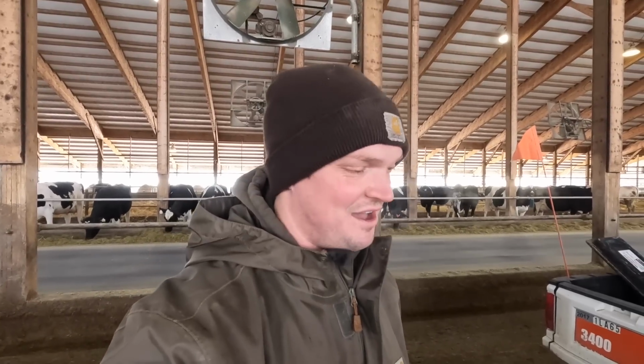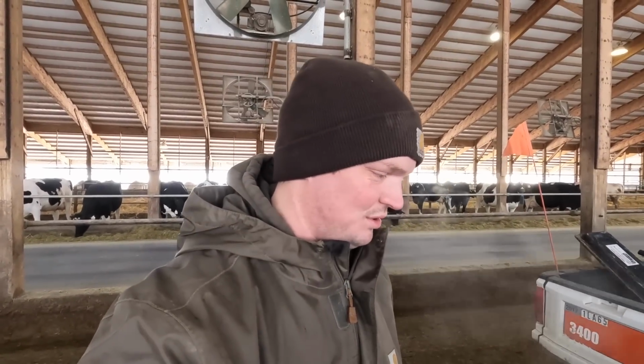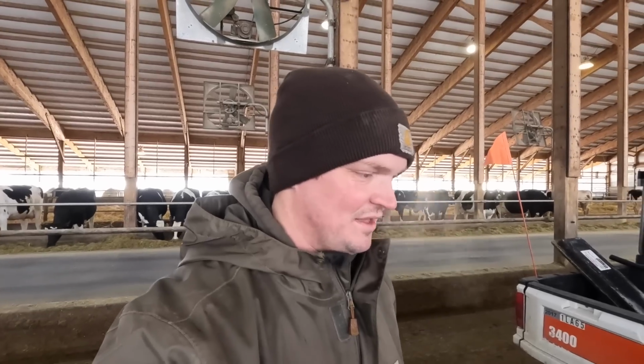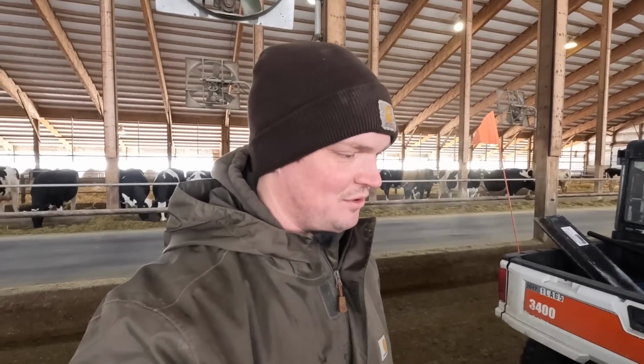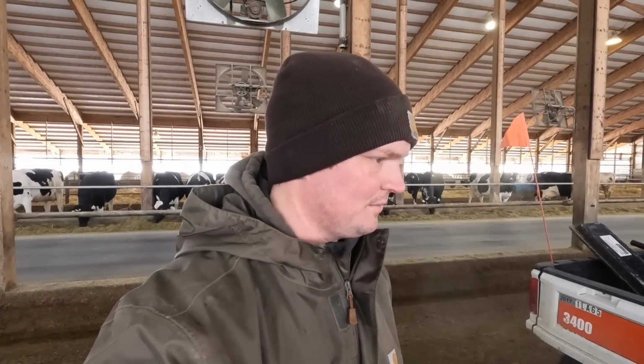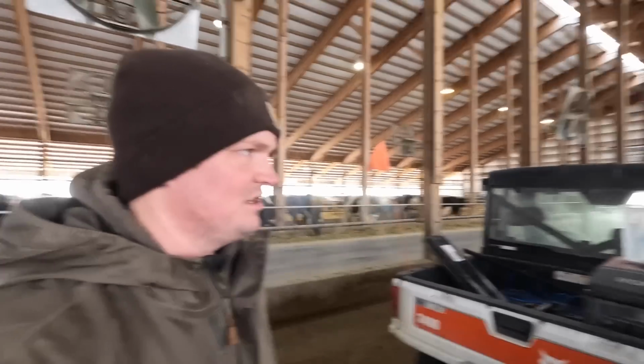So I dumped that hot water on the valve, and I didn't think I got the plunger loose, or that it was enough to get the rest of that top pipe unthawed, but it must have been just enough. I'll let that fan run a little bit longer, because I did try to move that valve and it feels like it's still a little bit frozen. But now that we have it running, I think it should stay running, hopefully.